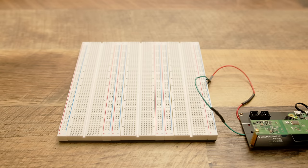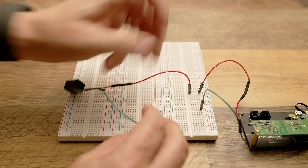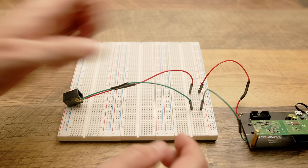and that's the modem telling you that it can't detect the telephone network. Now, in order to make this work, other people have built in solutions that literally use old telephone hardware in order to simulate a telephone network. I don't want to do any of that, and so I'm going to have to build that into the PCB design itself. Now, it happens to be easier than you might think.